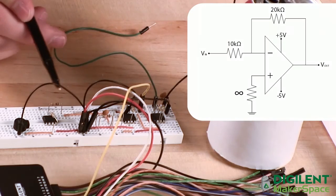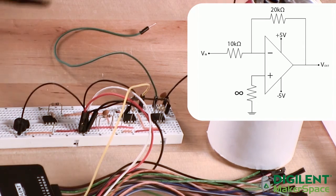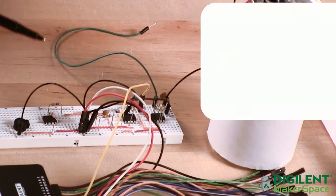The output from the envelope detector is ready to send to the speaker, but it wouldn't be very loud. So the last step is to send it through an amplifier to make it loud enough to hear. That's this portion of the circuit right here. This is an inverting amplifier composed of an OP37 operational amplifier, which is essentially the same as the OP27, along with a 10 kilohm resistor and a 20 kilohm resistor. This provides a gain of two, which doubles the amplitude of the signal, and then the signal is sent to the speaker — and that's what we hear when we play the theremin.